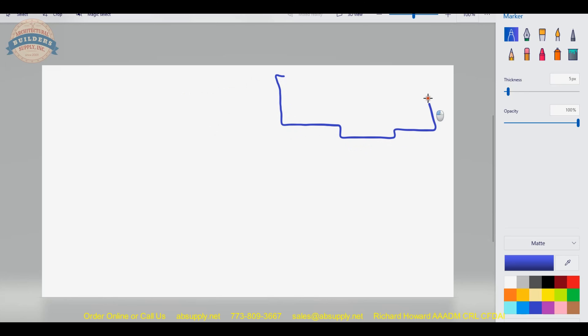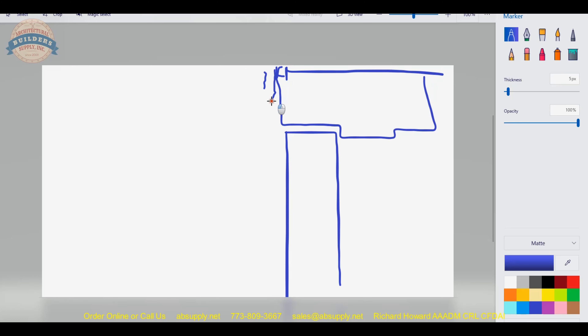What I thought of — and what has come to be pretty obvious — is this: if this is a header and you have your door sitting in here, let's say above this header you have 20 feet. On a single door that is 3 feet wide by 20 feet tall — that is 60 square feet of water being collected up there. That water hits the wall, trickles down the face of the frame, but it actually lips inside and starts to go down that way. When the drip cap is added, the water because of the curve cannot lift back up and will instead fall away.